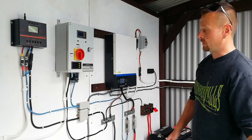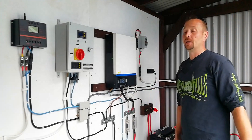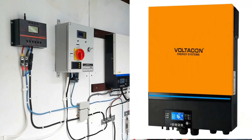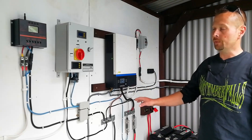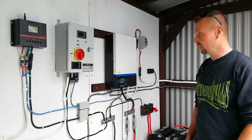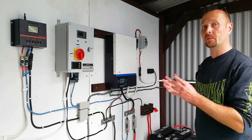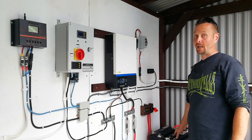Sure, what can I say? I had a lot of wall space, so I figured I'd fill it up with some artwork. Now, all joking aside, I went into this build knowing it was going to be temporary because this is on its way — it's the 11-kilowatt 48-volt all-in-one, big brother to this unit here. It should be with us in the next few days. Over the next week or two, we'll rearrange the setup into 48 volts and I will be using conduit, don't worry. Realistically, what I've done here is proved the point that low-budget DIY off-grid power is available to everyone, with a couple of days' worth of battery backup.